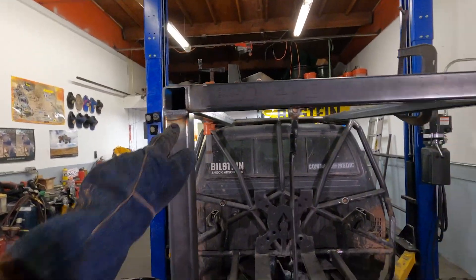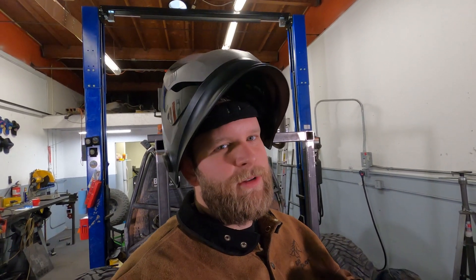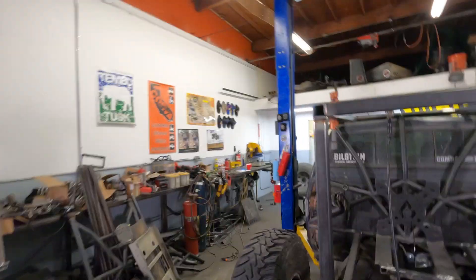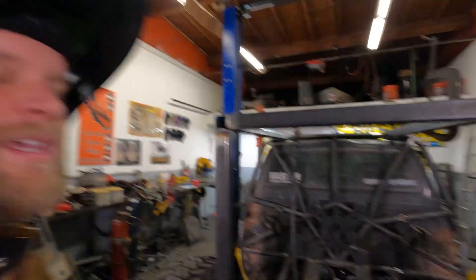What you might think I'm going to do is just go through and do all the welds in order. But what I'm actually going to do is jump around — usually corner to corner. I'll weld this one and then the opposite side, then the opposite part of that one and so on. All I'm trying to do is ensure that anytime you heat and cool a metal it's going to move a little bit, and you want to control that movement as much as possible by randomizing it. You don't want all the heat concentrated in one area; if you weld consecutively, who knows where all these tubes will start pulling. Jumping from section to section gives you a better chance of everything staying straight.